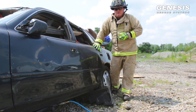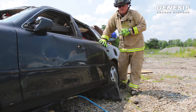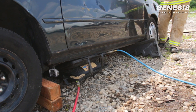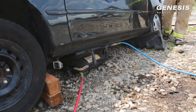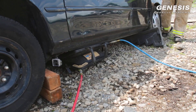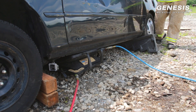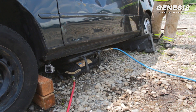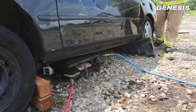I'll give the command to my control person to go down on blue. Down on blue. Now see how the vehicle is sitting down on it. Down on red. Now if you'll notice how we've already taken up all the void. And now we're able to, after we drop the bags, pull the bags out of the way and then we can make the rescue or whatever we need to do from there.